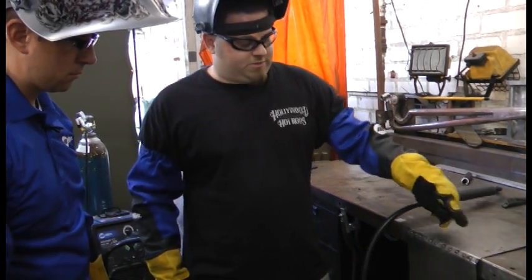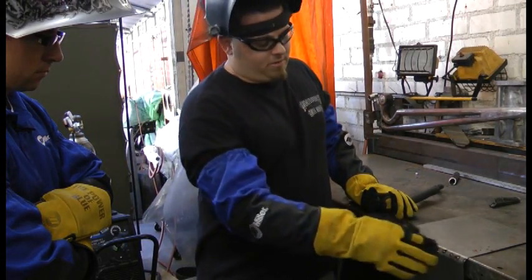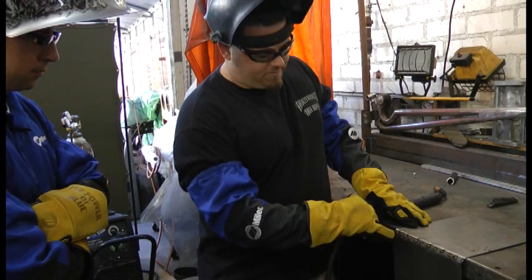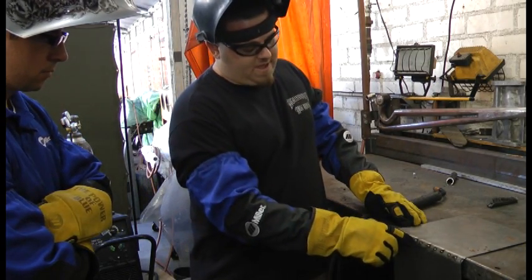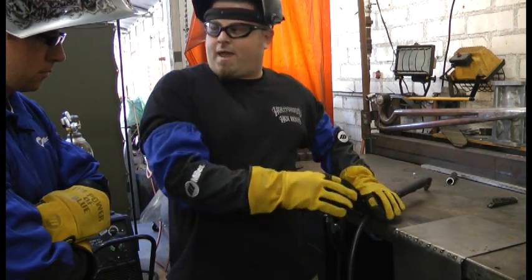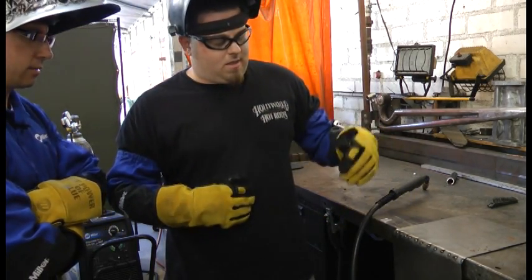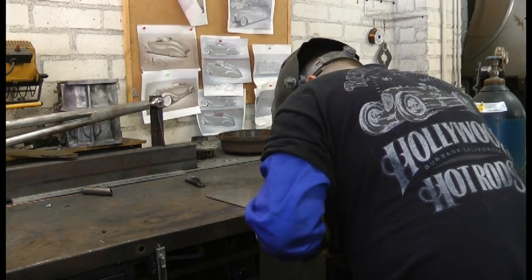Normally when I'm doing sheet metal, I'll go through and do my series of tacks, but I'll let it cool and then grind them down most of the way, so that I'm not building weld on top of weld. When I end up closing all these gaps, I actually get my penetration because I'm not building on top of the previous tack. And it also cuts down on the heat that I'm going to put into it when I'm grinding these down.